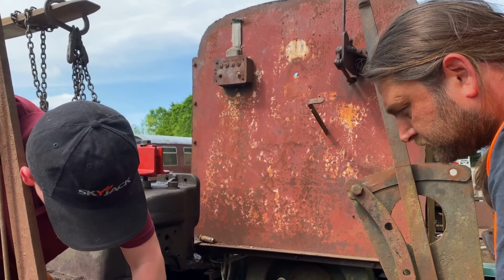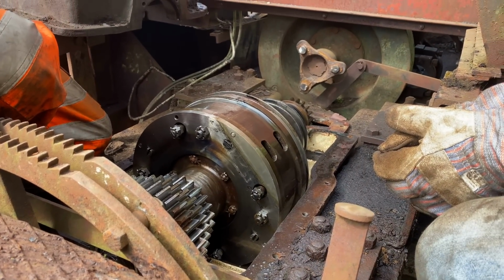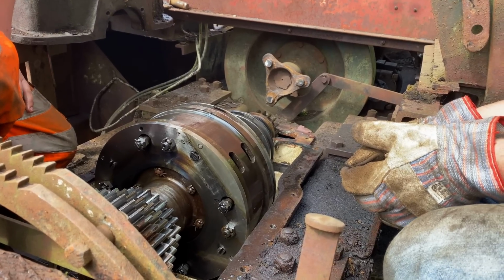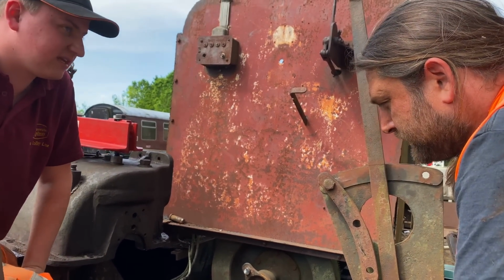See here how it is slightly purple. It's got warm because it had been overused. It does look like they've literally sent it straight into third gear from a standing start, which is probably what they were doing, causing excessive wear on the clutch. I mean, that's what it was for, not necessarily the most skilled workers and simple operations. The joy of the 48. That's the fastest gear, let's just put it in.